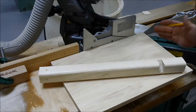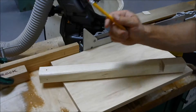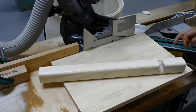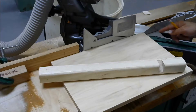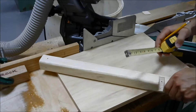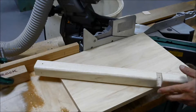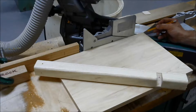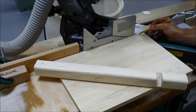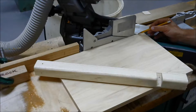You may find that you want to be cutting angles but still want all the angles cut to the same length. You can still use the stop block. In this case, I want to cut off all four corners the same — they all need to measure the same measurement, which is this angle on the leg. That measures exactly one and three quarters. I've previously done the equation: it measures one and one quarter along the leg of this right angle, so one and one quarter along the edge will make the hypotenuse one and three quarters of an inch.